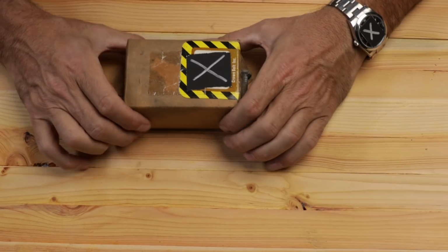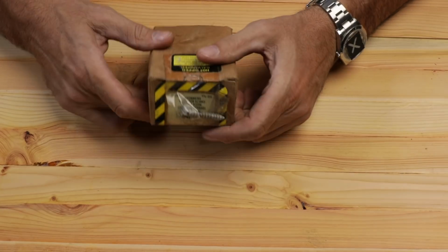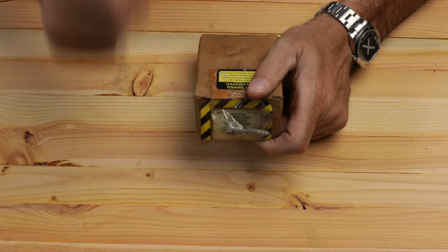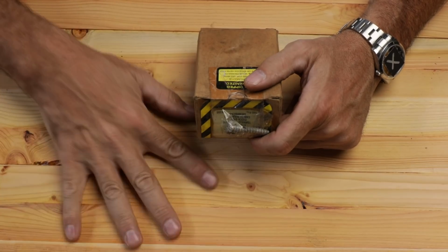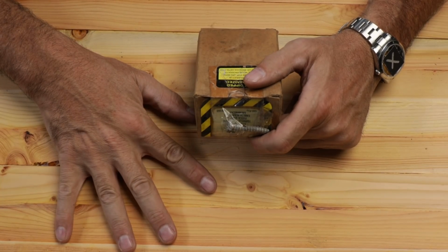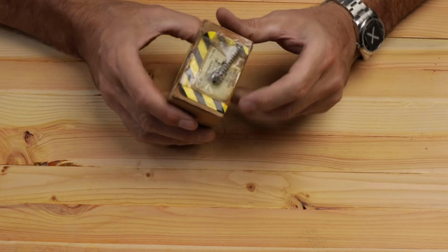To secure the legs to the top, we're going to use, of course, my favorite brand X bolt, lag bolts. We don't have to through bolt this with washers and all that stuff because just the weight of the bench is going to keep it on the stands. We just need to keep it from moving around. So we're going to use 16 of these lag screws.